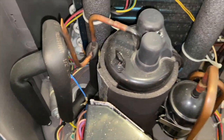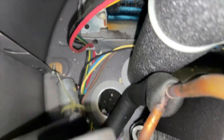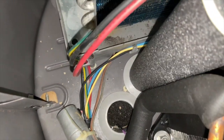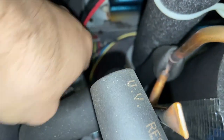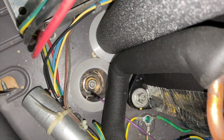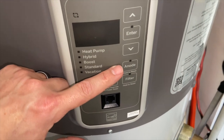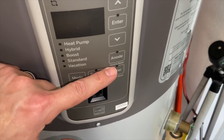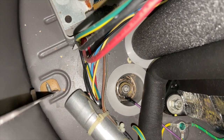With the covers removed you can see what's going on in here. The anode rod is actually going to be right down there — nice and convenient to get to. So you reach down and pull out the little well. I've encountered my first problem: on the top of the anode rod there is a bolt head, and I'm assuming — because this water heater has a feature that says 'anode,' although it does say 'hold to reset' — that there's probably some sort of sensing mechanism within the water heater to tell when the anode rod goes bad.